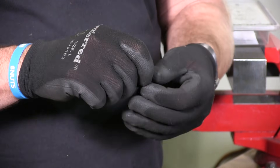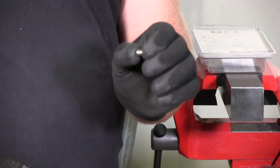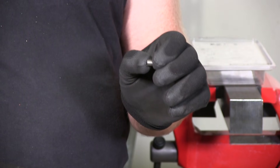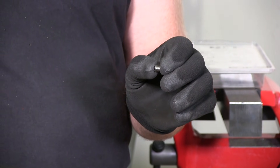In the helicoil, when you get it and if you measured it, it's going to be smaller in length. The length that they're quoting as one and a half times — which is 0.375 — is not when it's compressed, but when it's installed.